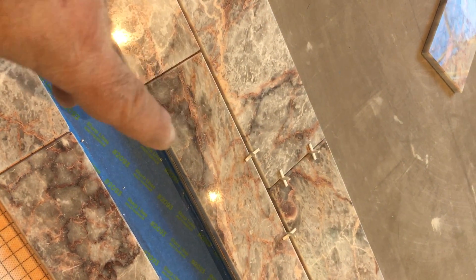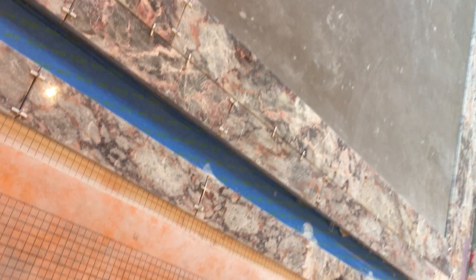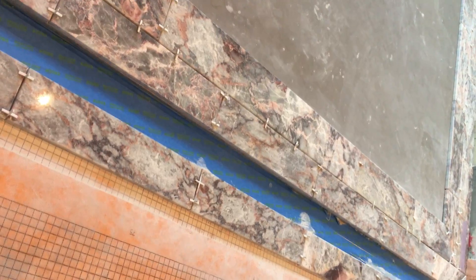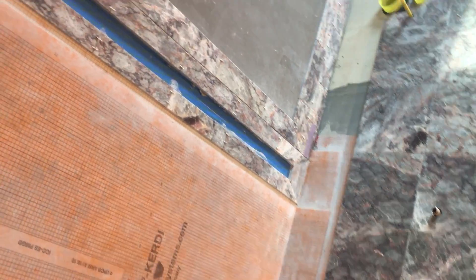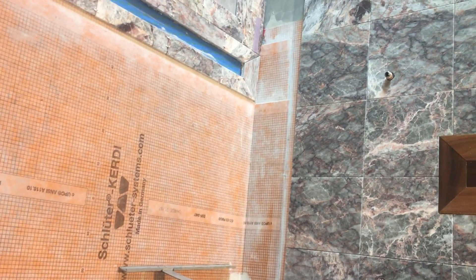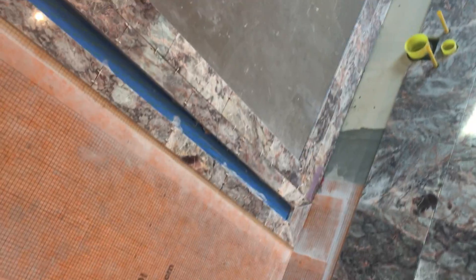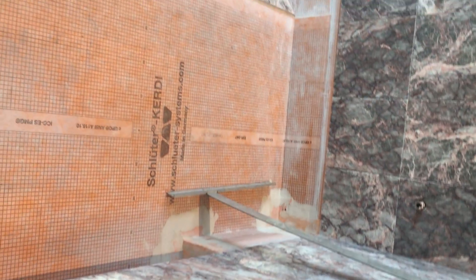We back pitch that intentionally. We usually stick the linear drain out near the glass line but not up against it, because we're trying not to create dark corners where moisture can sit. We want to get the floor to dry out on its own as best we can. Putting the drain out in the open space rather than in a corner gives better airflow and lets the tile dry — you need to let the tile get some air.